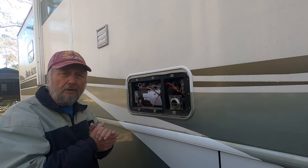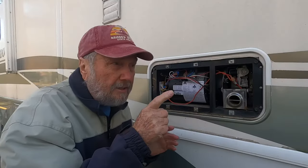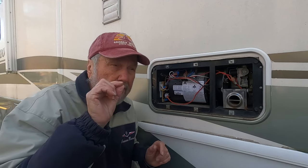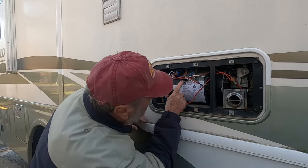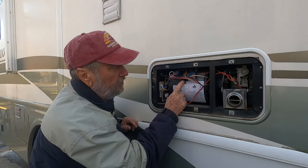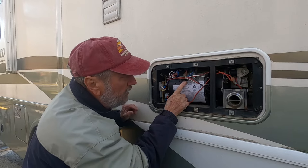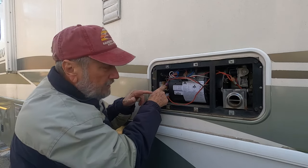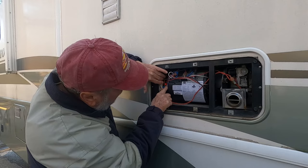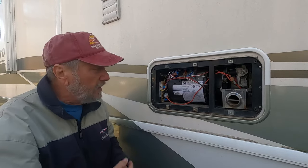I'm going to show you the conditions and how we can troubleshoot this. At my control panel I have the furnace on and the temperature at 80 degrees. Right here is a service switch — it's in the off position, and you'll have one on yours so you can do this without having to be inside. I turn it on and nothing happens, but the red light is steady in there, which means the board is most likely at fault.